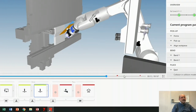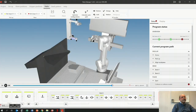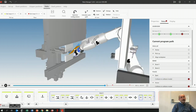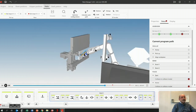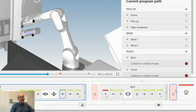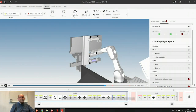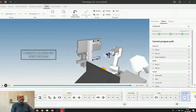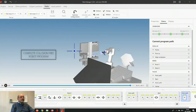These little dots indicate the collision, so if I go there I can actually see the collision — it will go through this thing here, that is not a good thing. But we've noticed the collision, so we've already done the next step: we've created two blocks in between the other blocks. These two red blocks are points in space which have not been calculated yet, but if I push this button it's calculating. We add points in space and now I have a complete collision-free robot program.